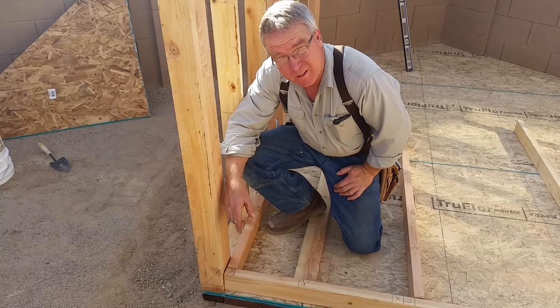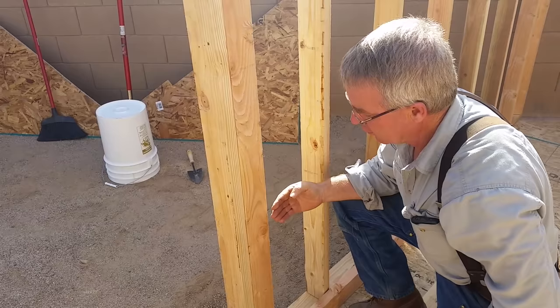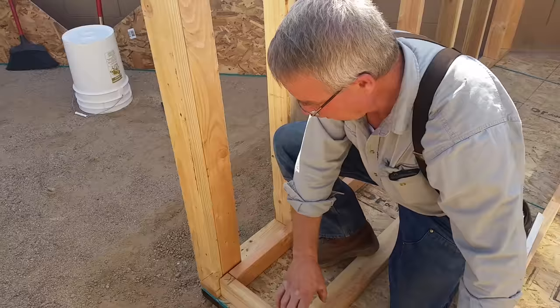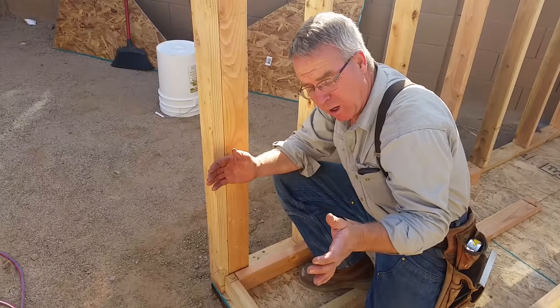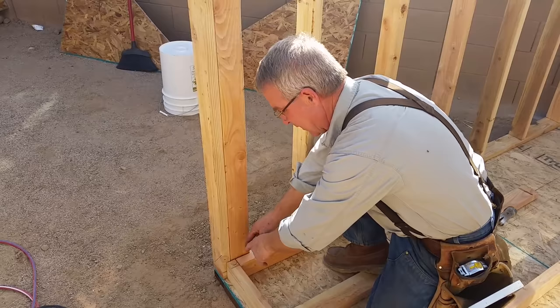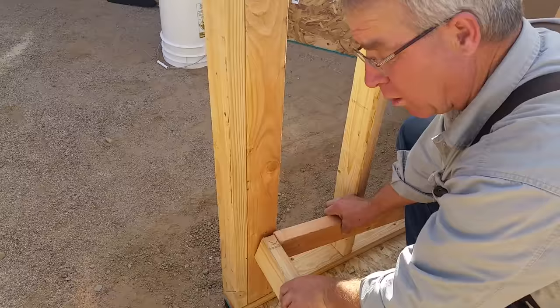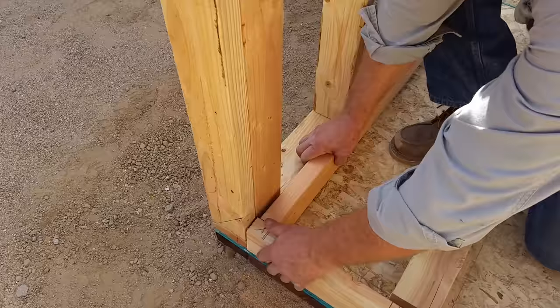Here's something important for putting walls and partitions together on the inside of a house. This is the California corner — you have a stud flat, and then you bring a single stud up against it flush to the inside. The intersecting wall is going to butt to that. It's important, particularly on a big job, that your top and bottom plates butt snugly against the wall they're running perpendicular to, so you don't gain some distance and make things out of plumb. If the stud is overhanging the end of the plate at all, the plate will never fit up against the other wall. So I hold it back maybe an eighth or three-sixteenths.